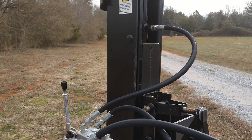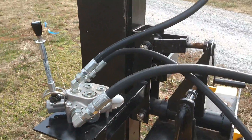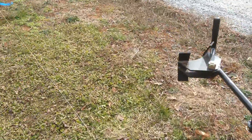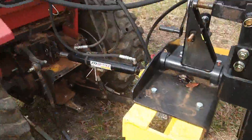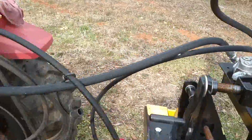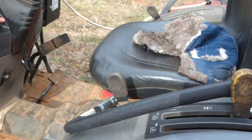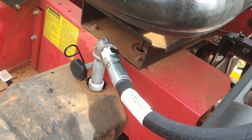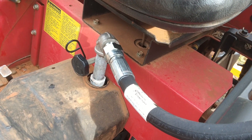When it does that it dumps hydraulic pressure back to the tractor, and so you can't really run it back through the remote — they say some people do apparently, but they say it's too much restriction. And so there's this big beefy return line here. It comes back.